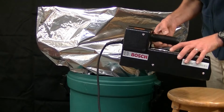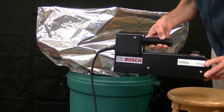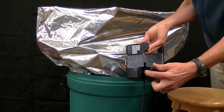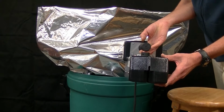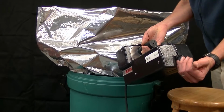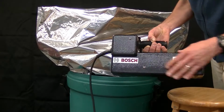We're starting at a temperature of 300 degrees for the initial seal that we're going to make. We may need to adjust that. I've pre-adjusted the heater bar gap setting, which is the space between the heater bars inside the HS-BII, to 25/1000 of an inch. That's 0.025 inches. And that's the space that the material will pass through as it's heated prior to it being fused together by the sealing rollers inside the HS-BII.